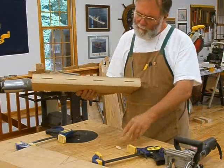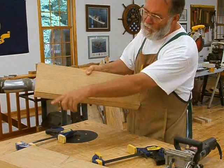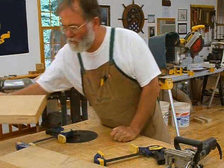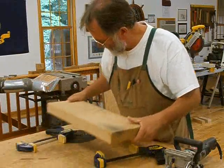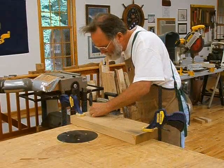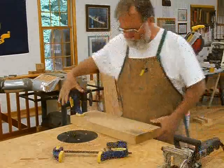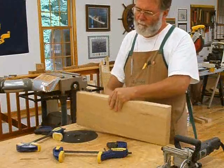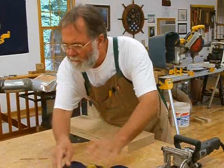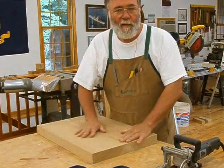We've got the four slots cut and the biscuit just fits in like that. I also made marks to know where to cut. When I had these pieces lined up, I made the marks straight across so that the alignment would be the same on both pieces.